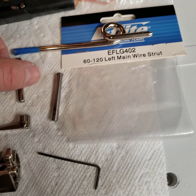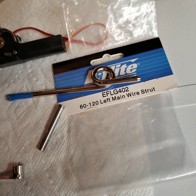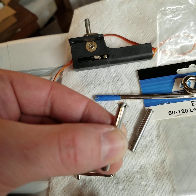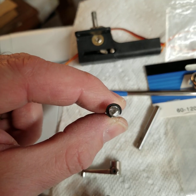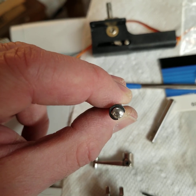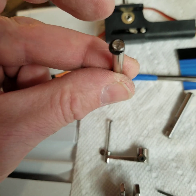The fix: because the factory pins have a head on them, you can't just pound in a cut piece. What I've done is cut the length, and then at the very top with a simple Dremel, I rounded the head and cut a very careful one-millimeter deep ring all the way around the new pin, then put in a c-clip. I test fit it gently every couple of turns with the Dremel until it snapped on in place with just a little bit of movement — then I knew it was right.